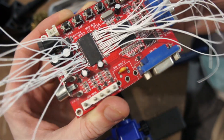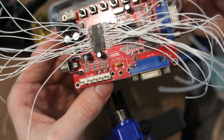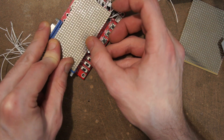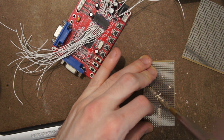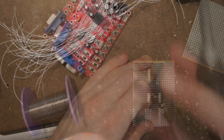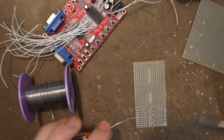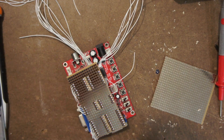Now that we've soldered all the wires onto that RAM IC, we can solder the ends of those onto a small section of perfboard that we can then adjoin to the converter itself. I like to cut out a section small enough so I can actually superglue it to the existing VGA connectors. This turns out to be a really solid solution and doesn't interfere with any of the connections on board. Here I'm making some cuts in the Veroboard to accommodate all of the different connections I'm running to it. I'll then tin the ends of these little traces so we can easily solder the wires from the converter and the ribbon cable that will run to the panel. I can then solder all the wires in from the converter, glue this piece of perfboard in place, and we've got nice secure connections.